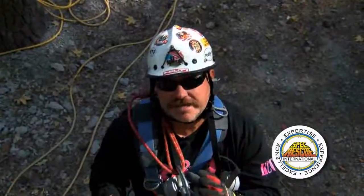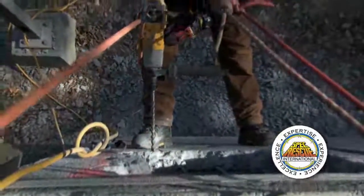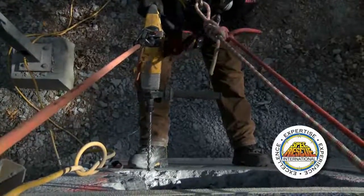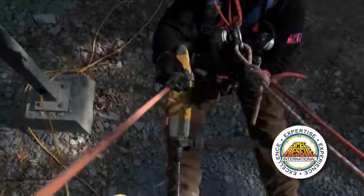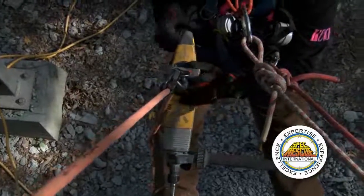Now that we've covered the safety equipment, let's talk about the actual tool we're going to use for this operation. What I have here is a rotary hammer with a drill bit in it, so I'm planning on doing some stitch drilling on this wall. One thing I've rigged up here is some sort of device to hold the tool, so I'm not holding all that weight the whole time — that's just added weight I'd have to carry on my system.